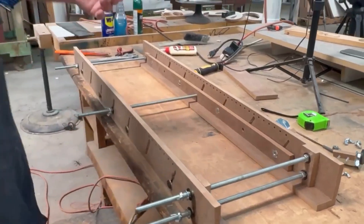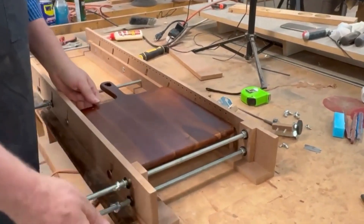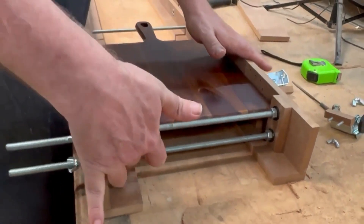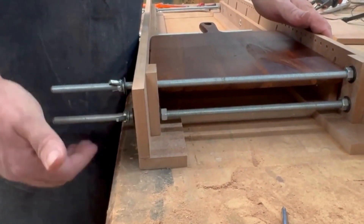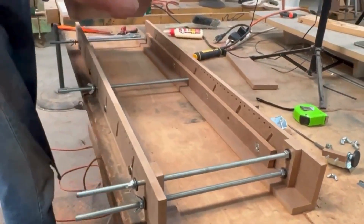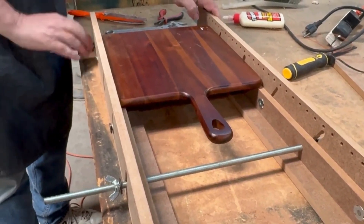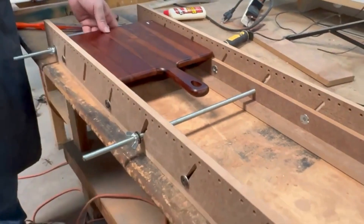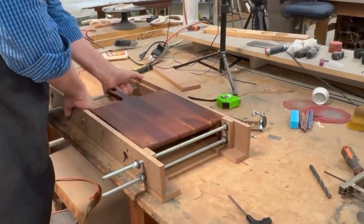Let's go ahead and mount the board. We've got a piece here — just a cutting board — so start by putting your cutting board in on one side and push it up against it. Tighten this screw by moving it over to where it stops — we're not actually putting any force on it yet. Then spin your wing nut in and tighten it down, making sure it's good and secure. Do the same thing on the other end, making sure that nut is just coming up, then tighten it up. This sets the width of the jig at the base so it'll go smoothly in and out of the machine without jamming, with both sides parallel to each other. Then go ahead and bring this up and temporarily tighten that to keep it in place.